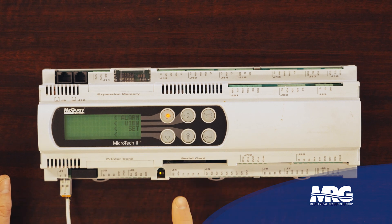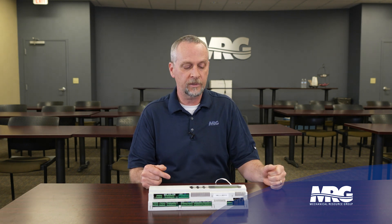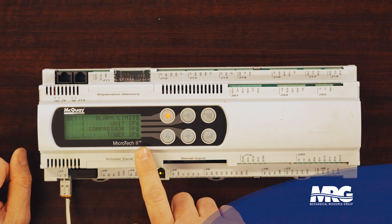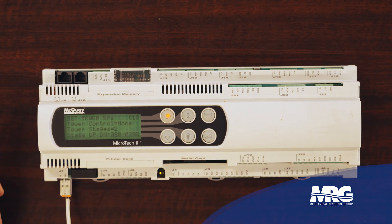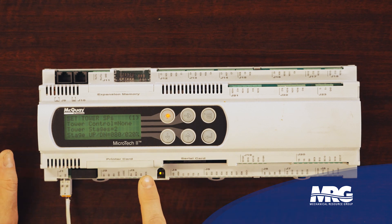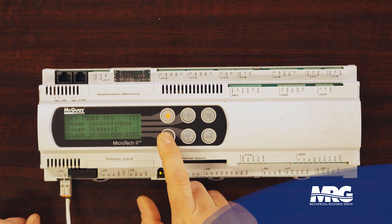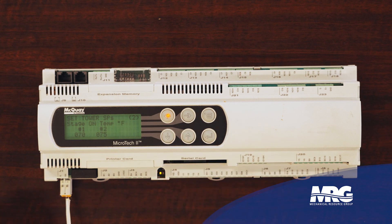Right now on this screen I don't have a fourth option, but I will later on. So we'll go ahead and press set. Now I do get that fourth option — as you see at the bottom, it says tower. With this controller, I could control some options on my cooling tower that's attached to this water-cooled piece of equipment. Maybe I'm just going to enable the tower to run and it's going to control off its own set points, or maybe I'm going to give the tower set points to stage the fan on and off based off water temp. So to enter that menu now, I see that I can follow the bottom line over to this bottom key and press that, and now I've opened up that menu. I know that I'm simply going to scroll up and down through these different menu options to set anything I wanted to set for that cooling tower setting.